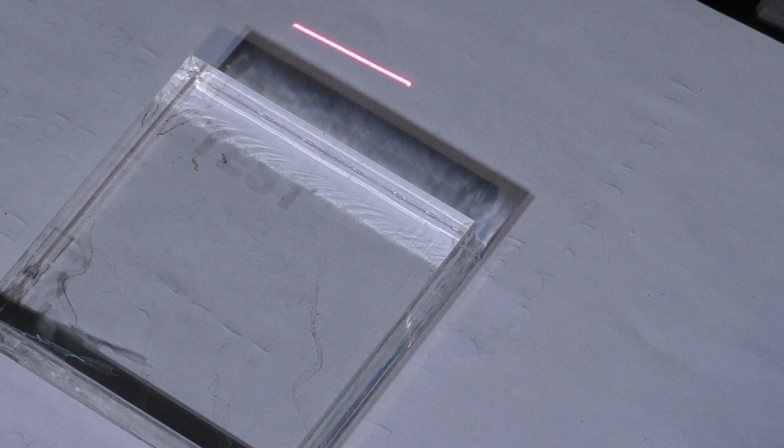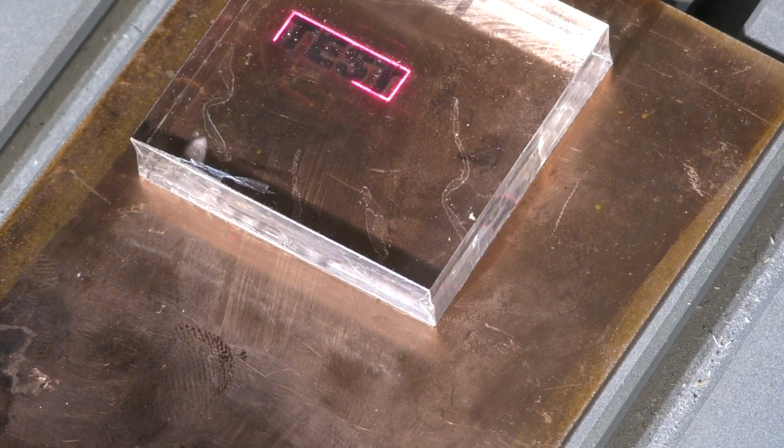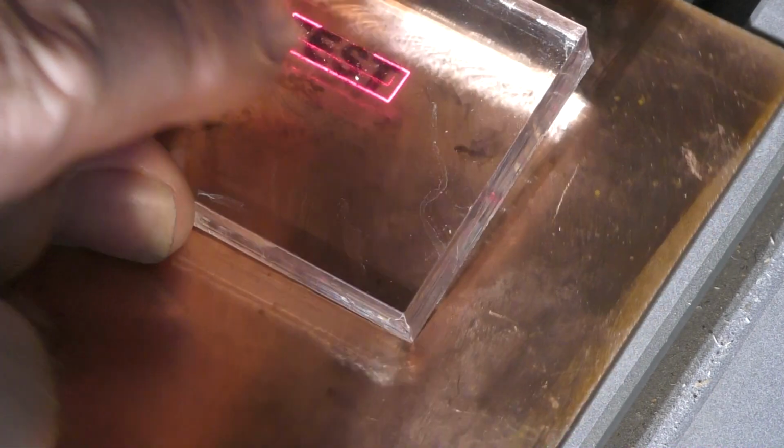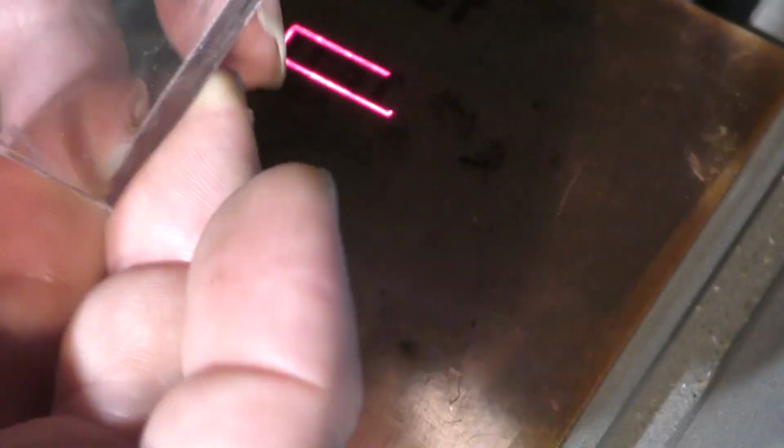So it must be basically almost smoke. But let's go down a little bit lower to 500 with our speed. Put more pulses in per unit of time. Now that's something rather interesting happening there. Hopefully you did as well. You noticed some speckles and some sparks as it was engraving. Now we've got a really strange effect starting to happen now.